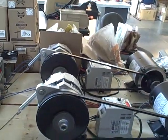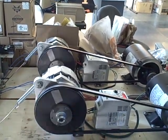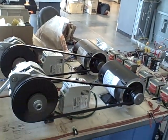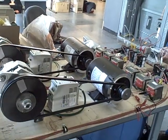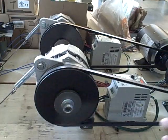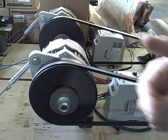Now I'm going to demonstrate what will happen when I trip the breaker. When I pop the breaker open, you'll see this start to drift again. One, two, three — trip. You can see immediately as I open up the breaker, these two generators are no longer coupled to each other, and they have the ability to drift. They are now independent generators.